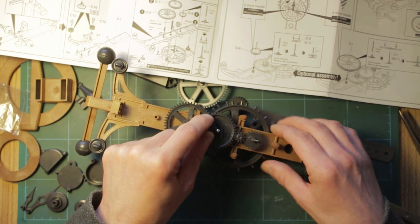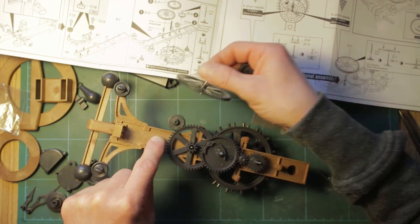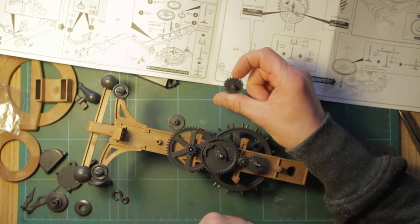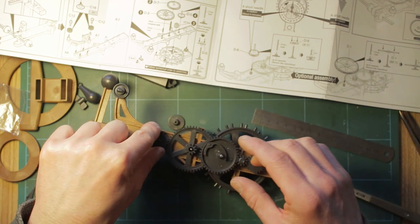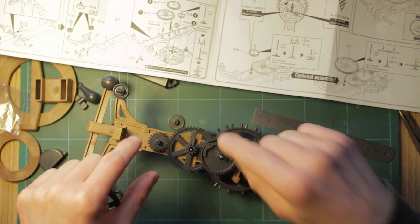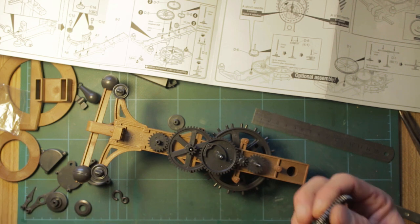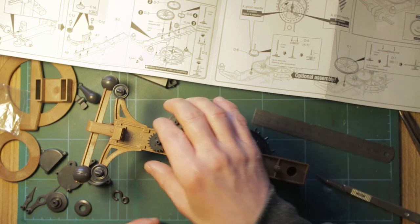You then have an option of two different wheels for the clock up here. You have D6, which is this tiny little one, which gives you a 4-to-1 reduction. That sits there and drives off the outer edge of this gear. And that gives you a much faster rotation of the hand, essentially giving you full rotation being about 4 minutes, which just seems a little bit odd. I don't know, unless you want to time an egg, maybe, something like that.